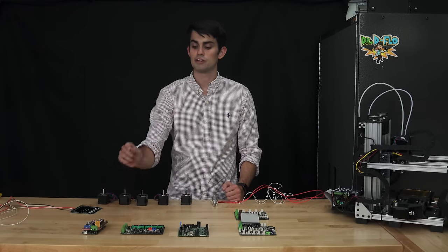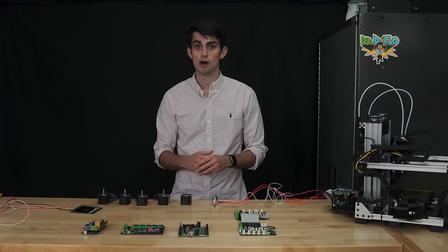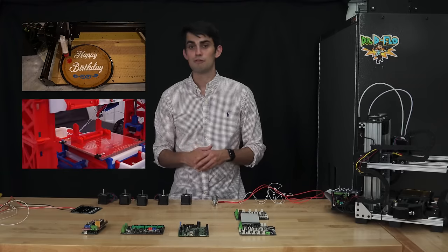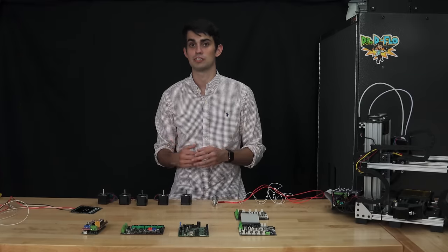The first 3 boards share the same firmware known as Marlin. Marlin is feature-rich, and its widespread use makes it easy to get help on forums during setup. I have used Marlin for years. My 3D food printer and 3D-printed 3D printer both used RAMPS running Marlin. The only negative side of Marlin is that it has so many features that it can be difficult for newcomers to navigate.